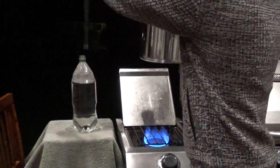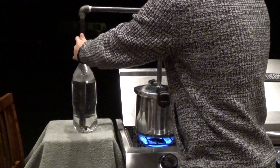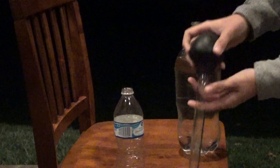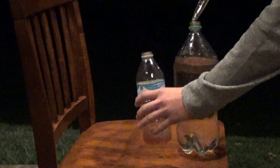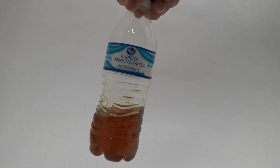As the plastic melts in the pressure cooker, it releases petroleum vapors. The jug of water acts as a cooling tank to condense the petroleum vapors as they exit the pipes. The petroleum floats, so it is easy to suck up. This is the yield of processing 1 pound of plastic — a little under 1 cup of fuel.